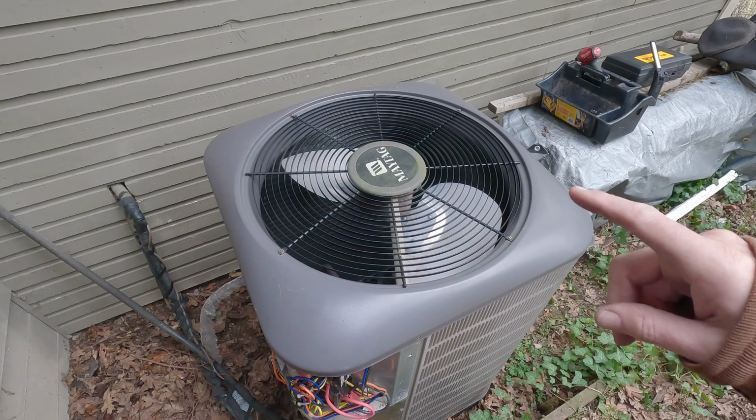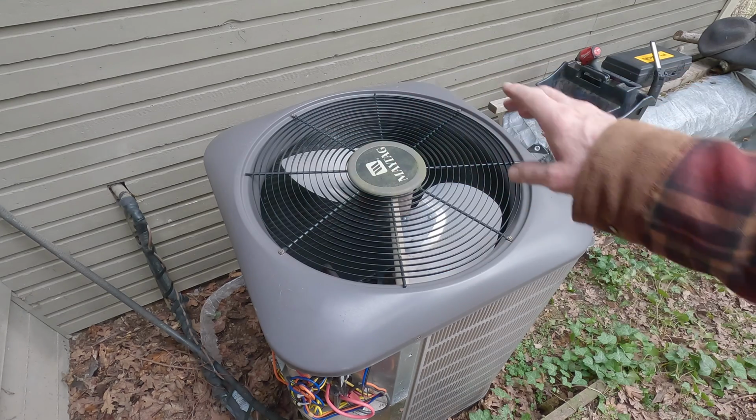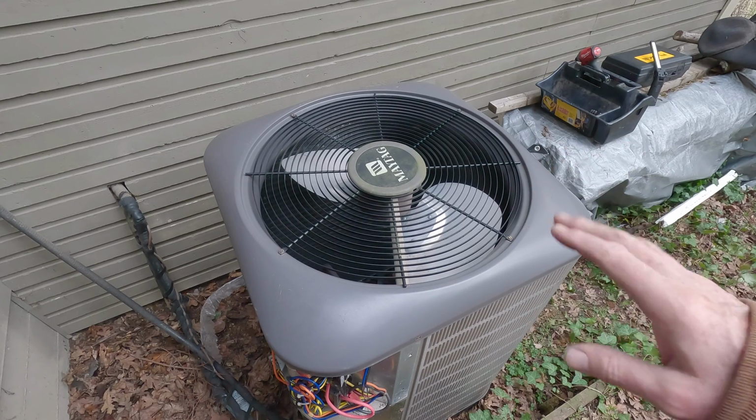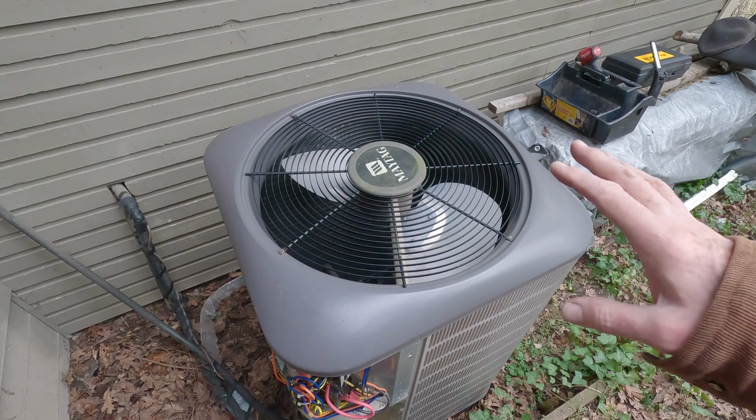So when I got back to the pump with power on, to my surprise, the outside fan was slowly turning, even though I'd turned the thermostat way down. I'm not going to reproduce that for you today. It's not good for sensitive electronics in the home, but it's further evidence to say that we've got some kind of a ground or neutral problem.